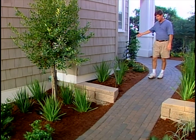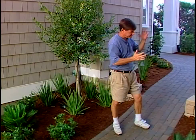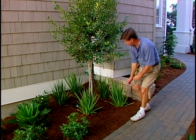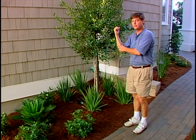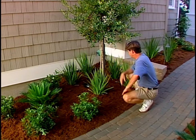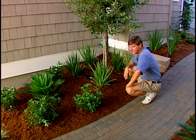Our time clock is installed over here for our lighting system, and the homeowner will need access to that to adjust the lights if needed. We didn't really talk about how we've staked these trees, but behind me, the ocean is just a little distance away - I can feel that air coming through, it's going to be like a tunnel. These trees, especially in winter with a Northeaster, are going to be beaten a bit. We've come in with a steel rod and some air-conditioned insulation to soften it, and driven a three-quarter-inch steel rod down the back of these trees and secured them to it. That steel will not blow out, so I feel like these trees are staked well. Instead of wires and flags, we've got a steel rod that's almost hidden - it almost looks similar to the trunk. So cosmetically, it does the job and doesn't look so offensive and it's not dangerous for little ones.